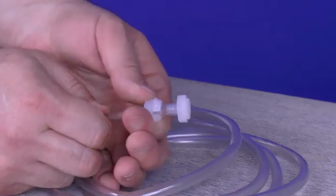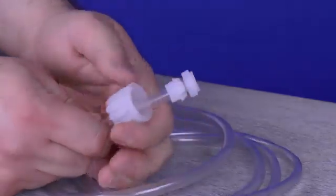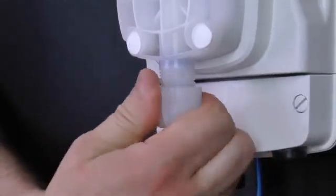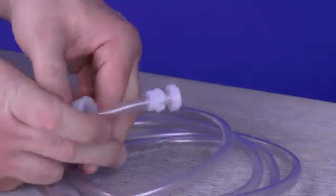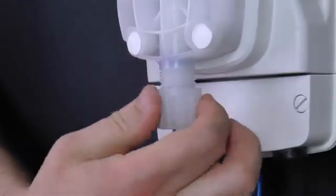Push the collar and nozzle together as close as possible. Pull the tube nut toward the nozzle to compress the collar and nozzle tight together, forming a ferrule connection. Attach the tube and connections onto the suction valve by hand tightening the tube nut. Do not cross-thread nor over-tighten. If the tube nut is not securing, recheck the ferrule connection — pull the tube nut toward the nozzle once more, then retighten until secure.